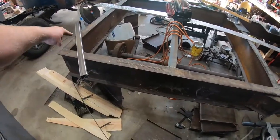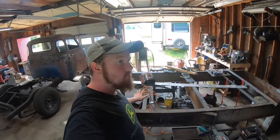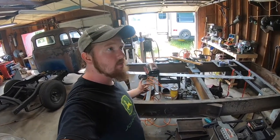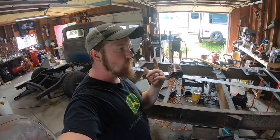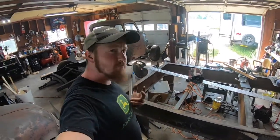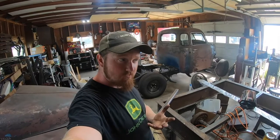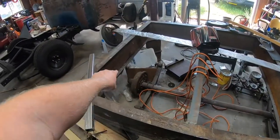They're gonna be L'd, and then I've been saving up money to buy a 3/8 plate, a 5x10, lay it over it, weld it, and then take some 1/4" material. The inspiration comes from the Certiflat welding tables. Some of them are as small as 1/8 inch, but they have bracing on the bottoms. So I want to take some 1/4" by 2" flat stock, and I want to go this way